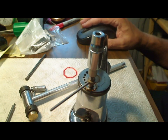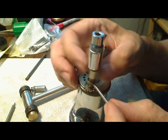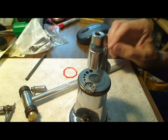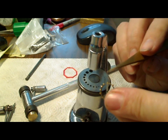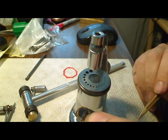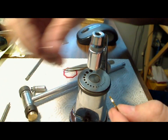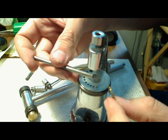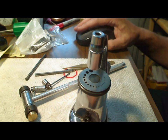I'll set this aside with tweezers so I don't lose it. Loosen this up, and then grab the balance — it's perfectly flat. By using that tool I'm able to check down the edge of it and yeah, it's perfectly flat. So by using that staking tool I was able to extract the balance staff: I cut the rivet away on the lathe, then used the staking set — which is for pocket watches and watches — with the different punches depending on the size of the pivot. Set it up, punch it, and you're good to go. Hope you enjoyed it and learned something!